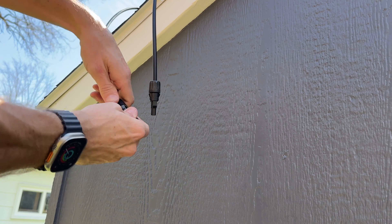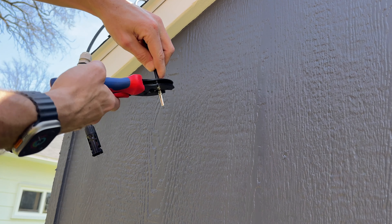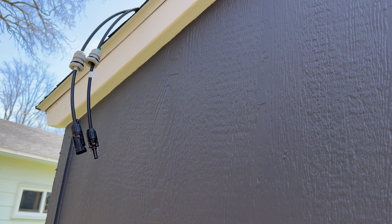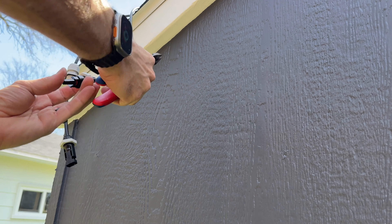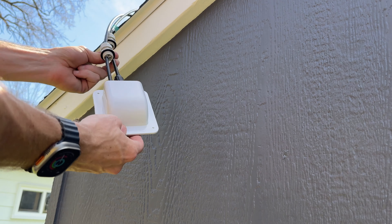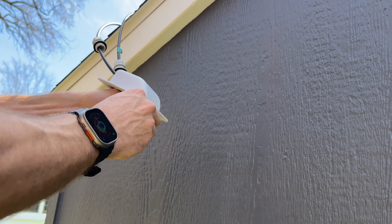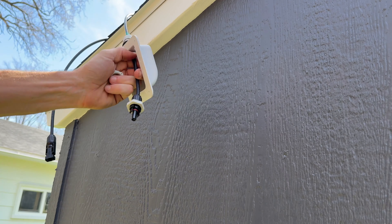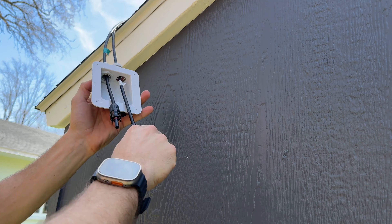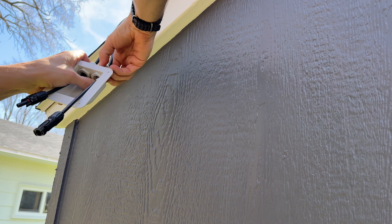Now I'll be able to get those gland connectors on, and I'll put the male pin back on with the female housing. I probably should have left off that plastic housing at this step — and here's why: once you put that other pin on, get the gland connector on, and then put the plastic housing back on, you realize the nuts need to come through from the inside first. They do fit over the MC4 plastic housings, but not very easily. So leave the plastic housings off, get everything mounted, then put the black MC4 housing on — it makes the order of operations a lot easier.